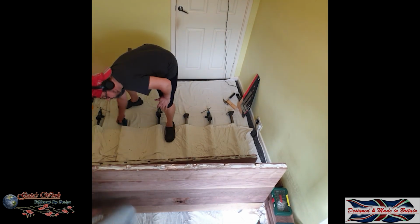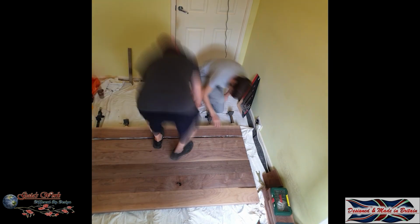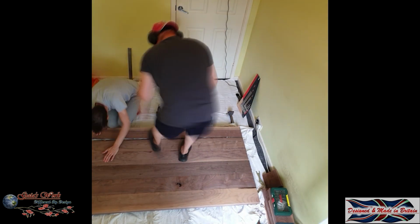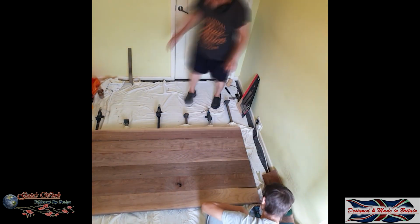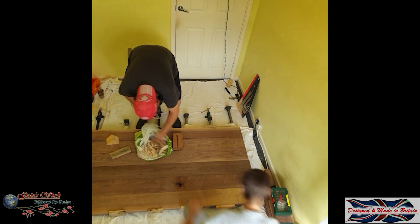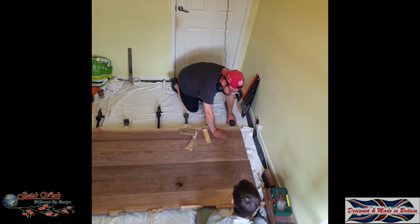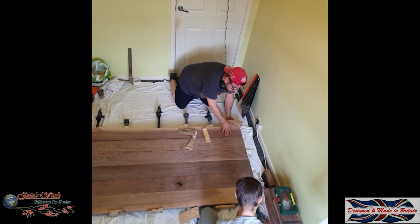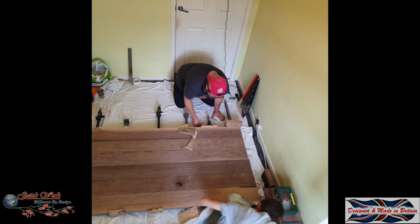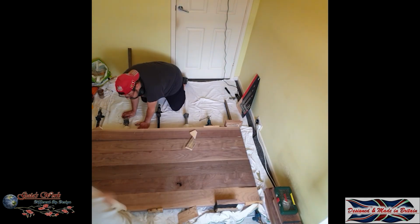Now, after you tidy up the clamps, what I did here, for example, every 10 minutes, 15 minutes, I came and kept on spinning the clamps and tightened the table even harder, but at the same time making sure that the in-betweens are not going to bend the shape of the table.